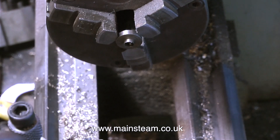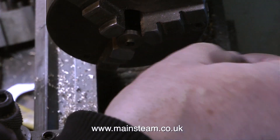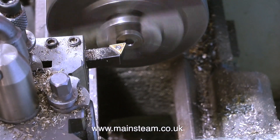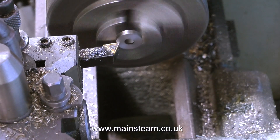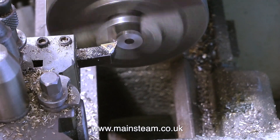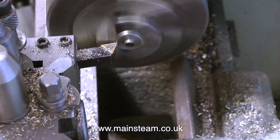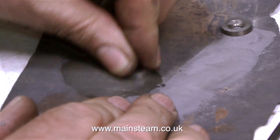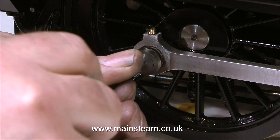Now I have to put these four washers one at a time in the chuck to clean up the parted end and make them all the same size. But I just can't get it to spin concentrically - this is where a lot of beginners fall down. The solution: clamp it in the chuck but not too tight, just nip it, then push it into position using the tailstock chuck. Clamp the tailstock to the bed with the lever, then rotate the tailstock handle, which pushes the chuck forward and in turn pushes the washer very squarely into the chuck jaws. This is a very simple and quick method for centering parts - though if you make missile guidance systems, space satellites, or jet engines, it's possibly not accurate enough for you. Personally, I'm rebuilding parts of a steam engine and it's perfectly fine.